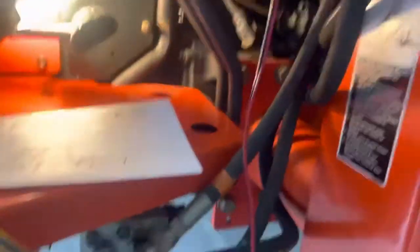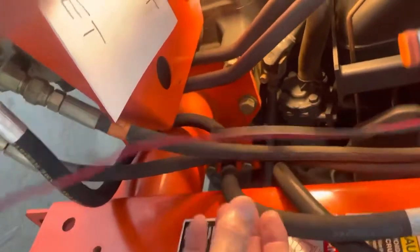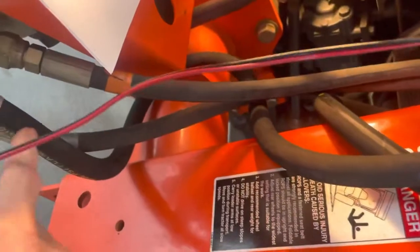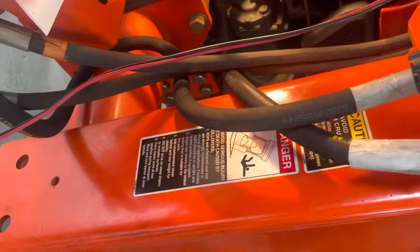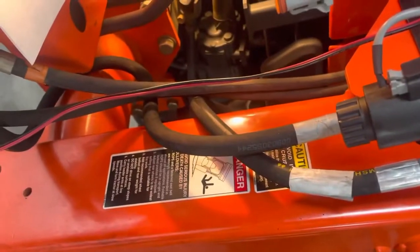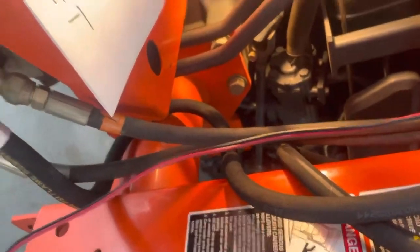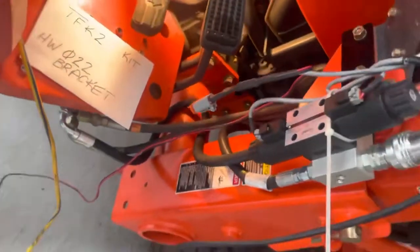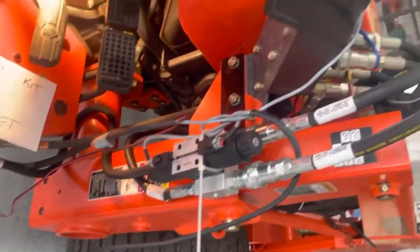The other thing nobody anticipated was this line that comes from the main valve body on the tractor and comes up into the Summit valve body. You can see how long this hose is — I had to wrap it all around and put a big U in it. That hose is going to need to be cut off about 8 or 10 inches and get a new input fitting so it can be properly terminated. That's just way too much excess hose. I'm not going to do that though until I get my front end reworked and get the quick disconnect system on and check everything out.